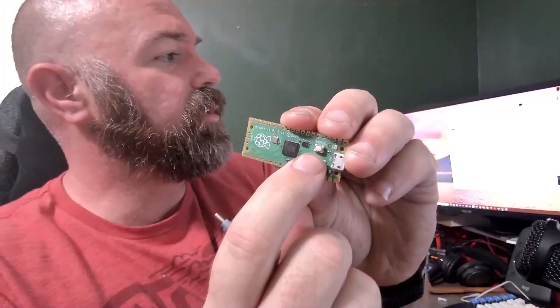Over at the computer, we need to download a few files. One of the things you'll have to do is get your Pico ready to write the software to. If you look right here, there's a boot button. What you're going to have to do is hold that button at the same time you plug in your USB cable. Make sure you grab the right cable - the one on AliExpress, I'll include a link to that as well - it gives you the full kit with everything you need.